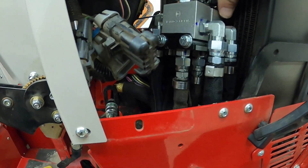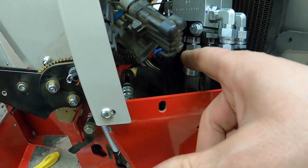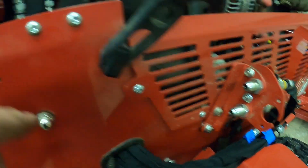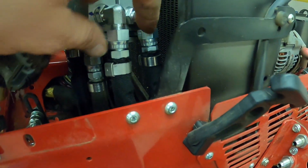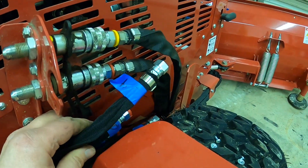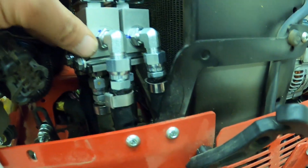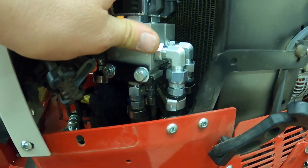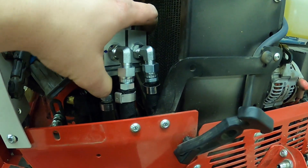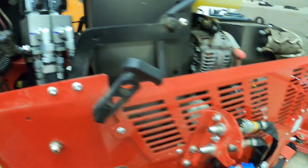I got the control valve assembly in. I did put the two hoses on the rear first, then I took the two hoses that were on the tractor, fed them up through, and attached them along with the other two auxiliary hoses. I marked everything one through four and noted which color they're going to be when mounted. The reason I did this out of the bracket first was it made it easier to get a wrench in there. I got all these tightened up really nicely because I don't want any leaks.